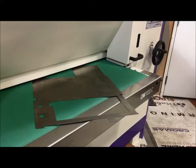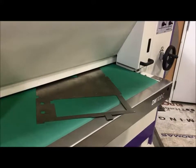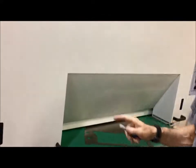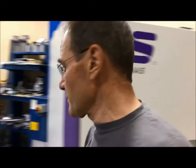And you can hear the brushes engage. On this machine right now, we have the new brushes where we have a slotted block, which is a little bit more pliable to inside contours versus the outside contours, so that we get a little bit better balanced result between smaller inside contours and the outside contours. The new development that we're looking at.